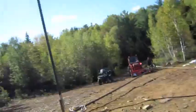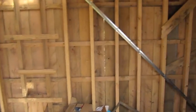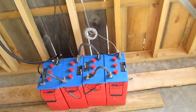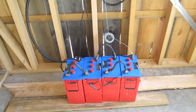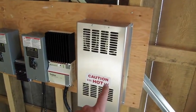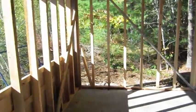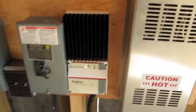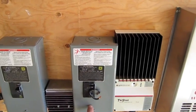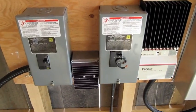The electrical components make up a battery charging system. We have a load diversion controller which takes the excess voltage and, rather than overpowering the batteries, bleeds it off into heat. In this shed we have four deep cycle batteries — it's a 24-volt system, so each is a 6-volt battery. We have the load diversion controller here, which will eventually help keep this shed warm. Then we have the TriStar controller and a fuse to protect the equipment in case of a problem.